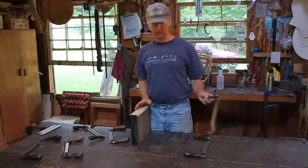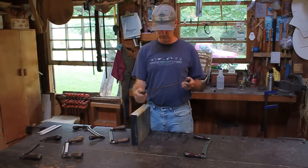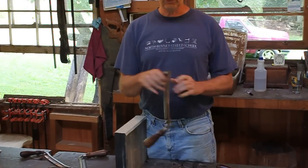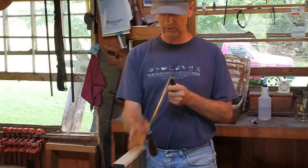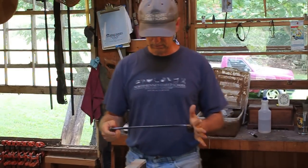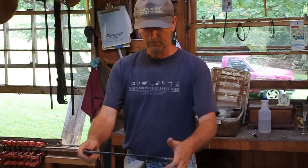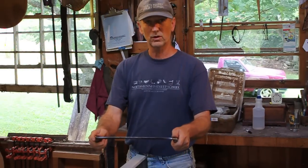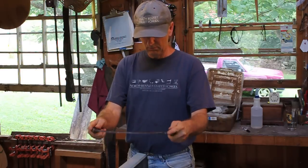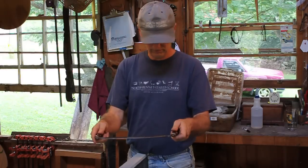One of my favorite ones right here — my brother-in-law found that knife in a junk store. It's a bevel up or bevel down knife. I use it with the bevel down, and the reason I do that is because the back of the blade is in line with the handles. So when you use it, you put it on the wood, it sits on the bevel, and your wrists feel real comfortable. Whereas if I tried to turn it over and use it bevel up, I'd have to move my wrist down like this — you can use it like that, but it's just not as comfortable.